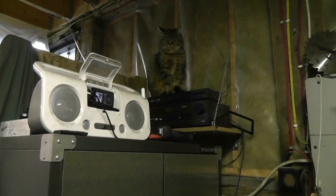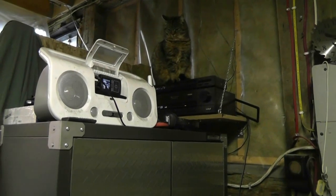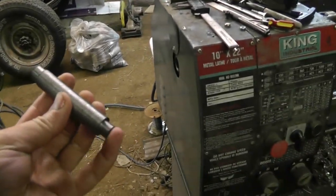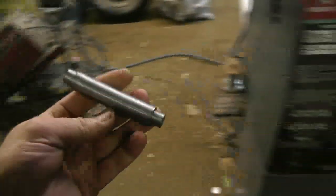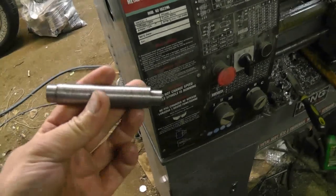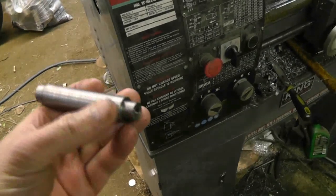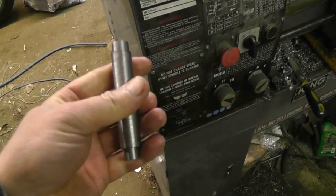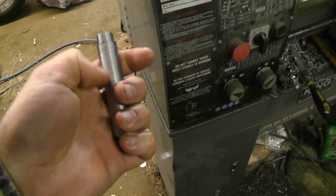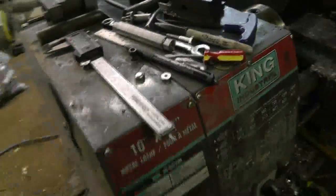I've turned one blank so far. This end will be the top end that sticks out of the top of the rotary table, and this end will be secured with a bolt to hold it tight in the taper — it may not be necessary but I'm going to do it anyway. I don't know that I'm going to do a good enough job on the taper that it will hold really hard. I'm thinking this is hot rolled, because it didn't turn very well — even at a slow traverse speed it still leaves a pretty rough finish. Anyway, that's it for today, but I'm not going to post this video until tomorrow night or until I've done one of these completely.